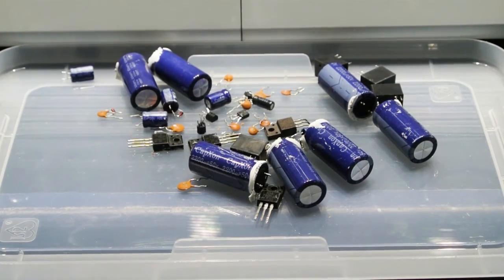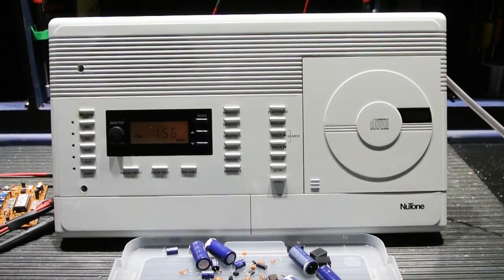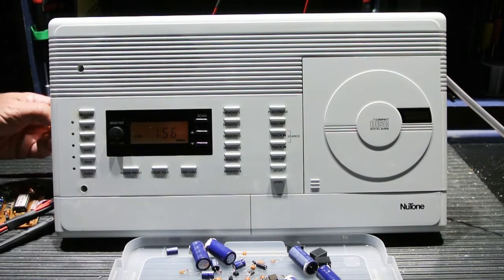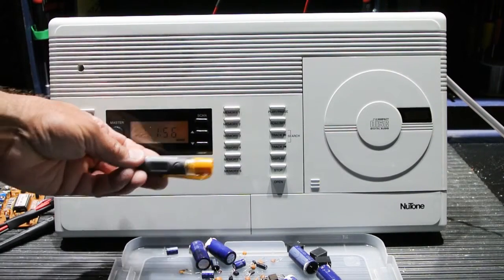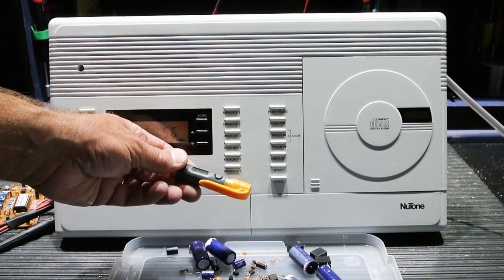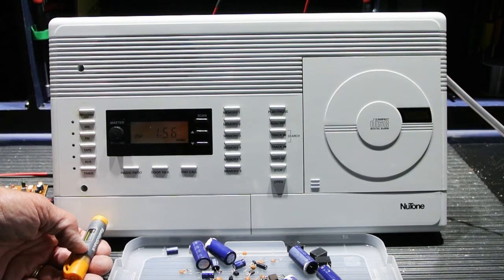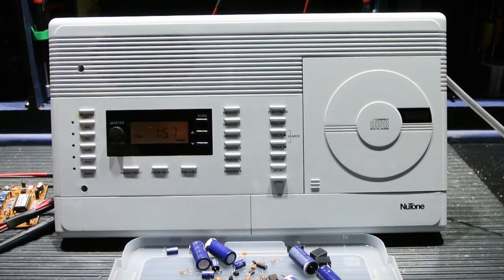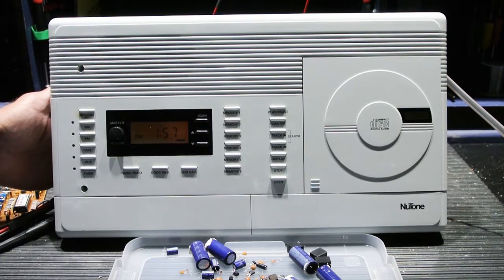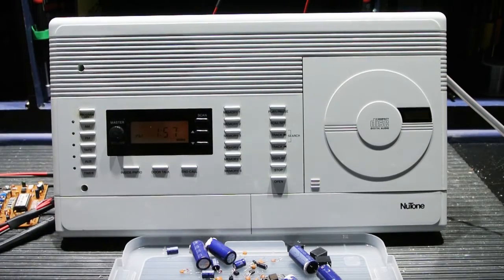Let's do a quick measurement of our voltage regulator to see where its temperature is. It shows a very reasonable 46 degrees Celsius. And if we compare that to the faceplate, the faceplate is about 33 degrees Celsius — you would expect the plastic to be cooler. Voltage regulators generate some amount of heat, but it's certainly very cool to the touch. And with the heat sink bracket modification that we install in these type of repairs, this problem should not repeat.